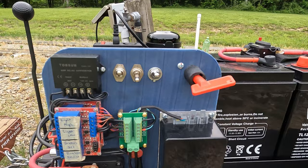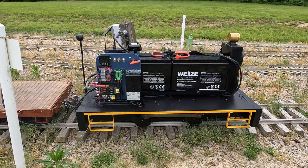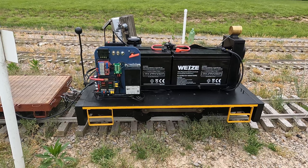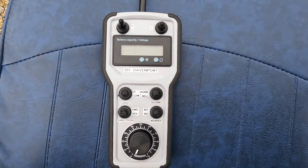The silver toggle switch on the far right disconnects the motors. When the motors are engaged they're basically trying to charge and regenerate, so you really cannot push or freewheel the locomotive at all. Being able to disconnect the motors makes it a lot easier to roll it in and out of a trailer.